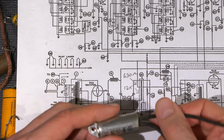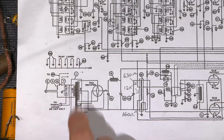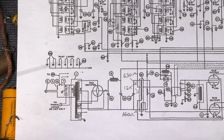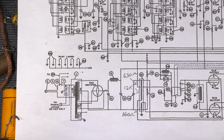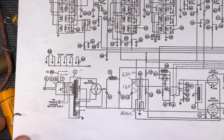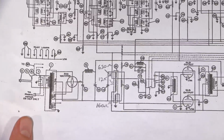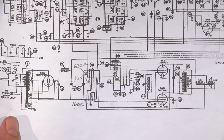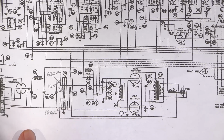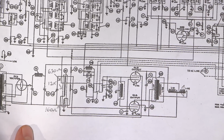So this capacitor here is replaced with a modern X1Y2 rated capacitor. So there's 2 of them, all right, one for each one. They're X1Y2, so they have very good safety ratings. They're actually a certified safety capacitor. So when they fail, they fail in the correct mode and don't cause issues. Okay, so they're known as X1Y2 rated safety capacitors. If you're more interested in that, you can look those up. In fact, I have a bunch of those capacitors listed on that verified components list. I believe they're in there. That may have been done after that. If not, it'll get added at any rate.